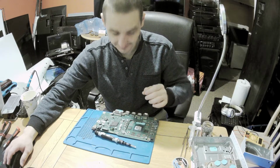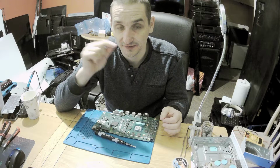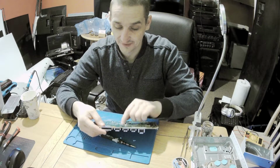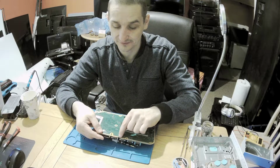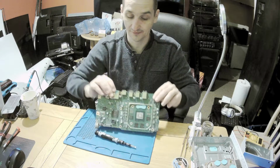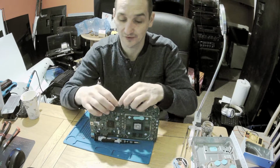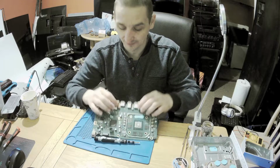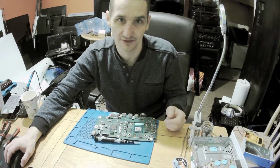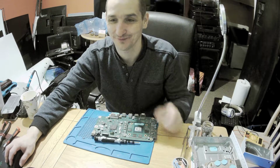Pins are connected. The only problem is that some of the pins are connected together. We can't leave it like that. And I've checked, one of the legs is not melted inside with solder, so that needs correction as well. It could be okay as is, because this type of port has those extra securities here. But if the job is worth doing, let's do it right, yes? So be right back, hopefully in this episode.